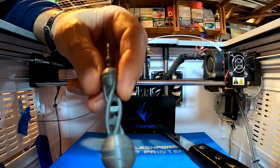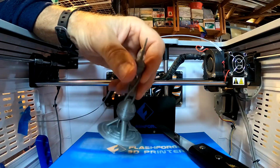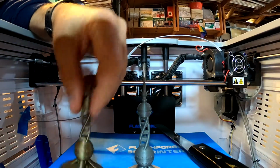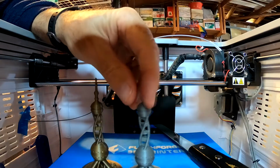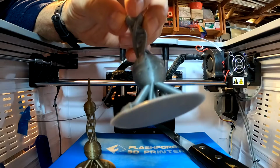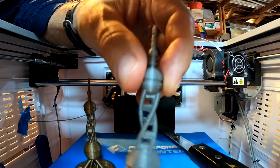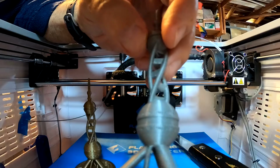And there's a little bit of stringing between the helixes, but if you look at the Amazon one, this is PLA now. It had a little bit of stringing as well. So the bridge at the bottom looks perfect. This is amazing. I have to believe that the change was putting 100% fan and leaving the door open.